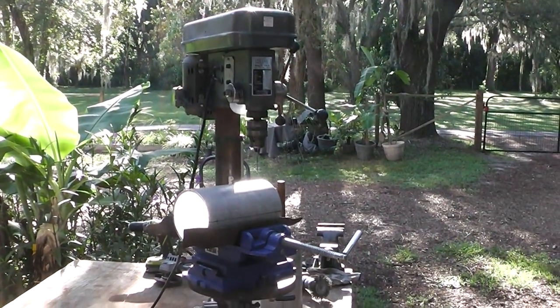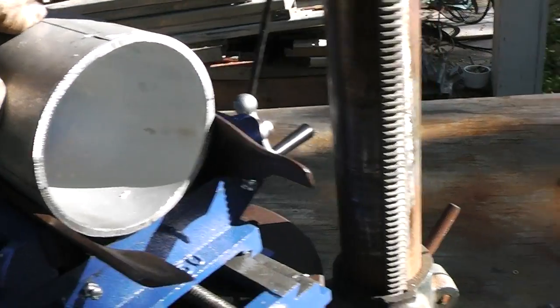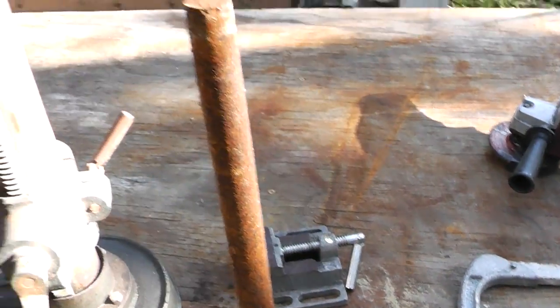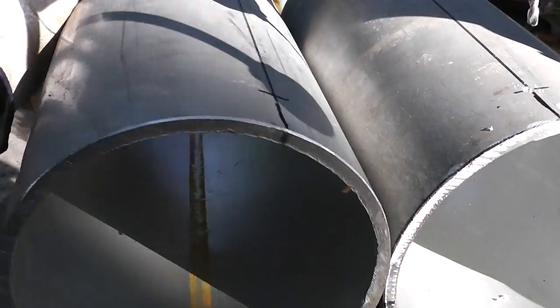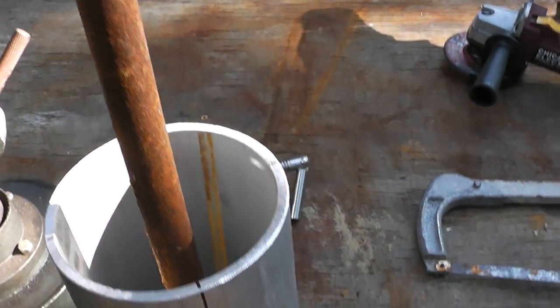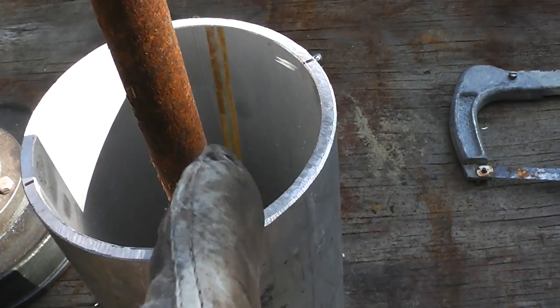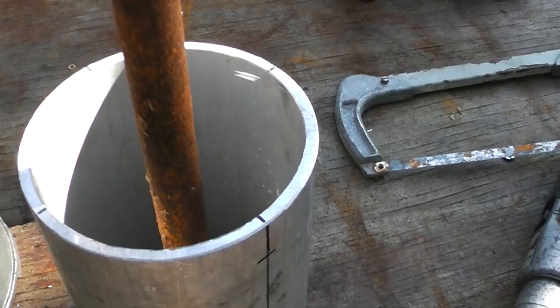I'm going to try to make this build as low cost as possible. I'm starting with the rollers - these are just some mass pipe that somebody was getting rid of. I cut it up and they're about five and a half inches in diameter. The idea is I'm probably going to fill these with concrete. I've got them marked in four locations and I'm going to use a one-inch cold roll steel rod left over from the dump trailer project. I'm going to tap these with a three-eighths inch tap, run some all-thread in there, center the rod, and tack weld it on both ends.